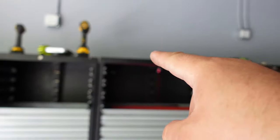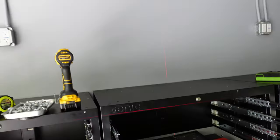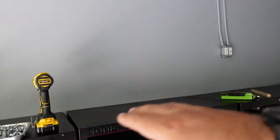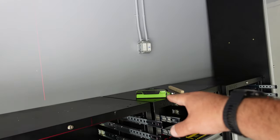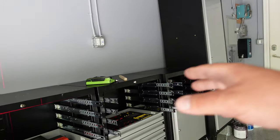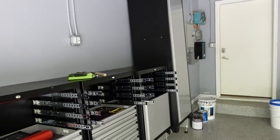I've put a lag on there and there — basically there's a beam here and a beam here. What you can also do if you find yourself with only one stud or beam behind the cabinets is you can bolt the cabinets together, and that will also give it some more rigidity. Now I'm going to move on going left, level this cabinet, push it close together, and then find the studs on that one too.